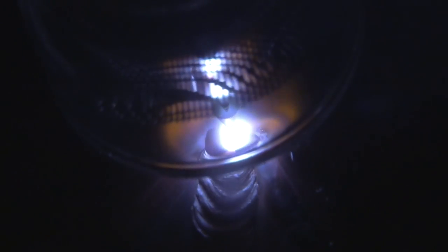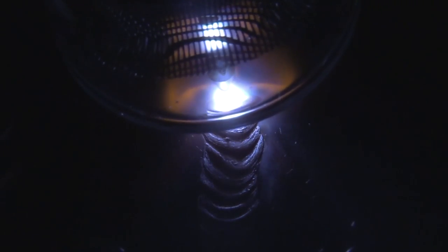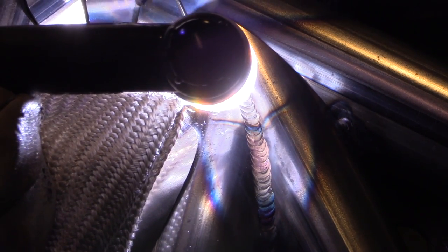Looking through the back side just to show what can be done when you can only see the puddle through the cup. Not coming out of the puddle very far at all with the tip of the rod — you want to keep the hot melted tip always shielded with argon whenever possible. It's not so critical with aluminum because aluminum cools so quickly, but with steel and stainless steel, pulling the tip out of the argon and back in can really put oxides on it, making the puddle swim around and sluggish.